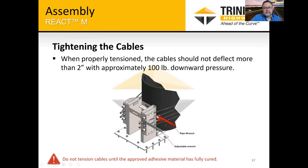The cables are not tensioned when the system ships from the factory. Once it's installed in the field and everything is anchored down, you want to come back and make sure these are tightened — what we call taut — which means two inches of deflection when you use 100 pounds of pressure on the cables. They don't have to be high tension by any means, but they need to be tight and run level up the side of the system.